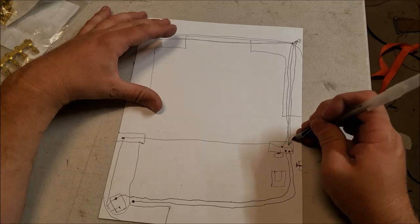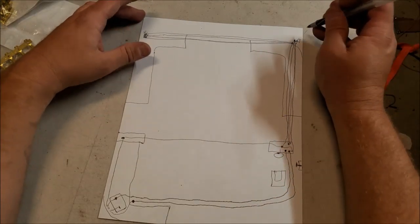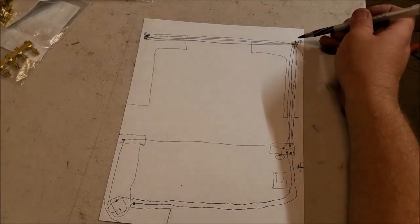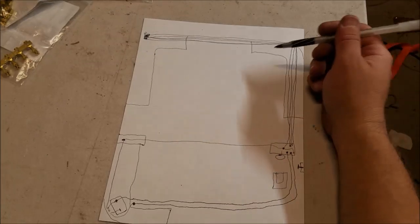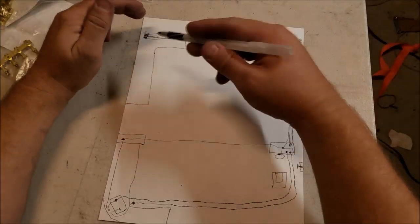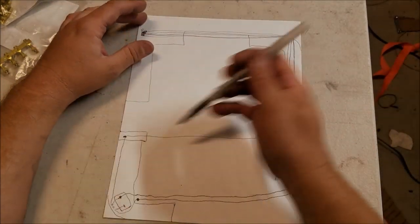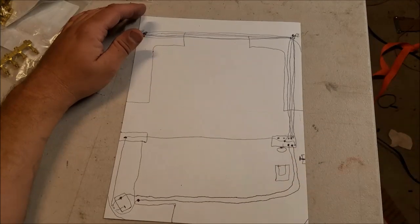Now we also have interior lights, so those will also need to go there. I'll make a little terminal block or something up here. So we'll have one there, it'll run across the boat and plug in over here. So we need a 4 power wire up there and across that'll power accessories, lights, horn, and a ground. So that's basically it for what I need in this console. So for now, I need to run a power wire and a ground wire along the floor into the console.